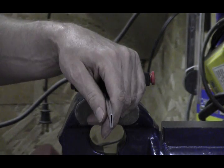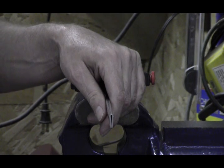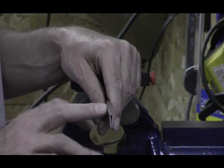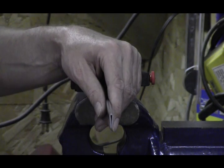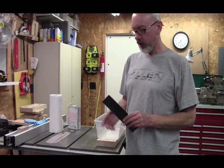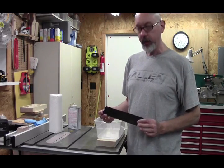This process worked out pretty well, though it's kind of tedious. It also introduced some bend and bow back into the back, so I had to go back to the anvil with the dead blow hammer. I used a dead blow so I wouldn't put big dents in it that I couldn't file out — it's a plastic hammer with some lead shot in it. It gives a pretty good shot, not as good as a steel hammer, but I was able to straighten it and get it all back in kilter. I've jointed all four edges just to get everything trued up and deburred. Now I've got this bluing on here to deal with.